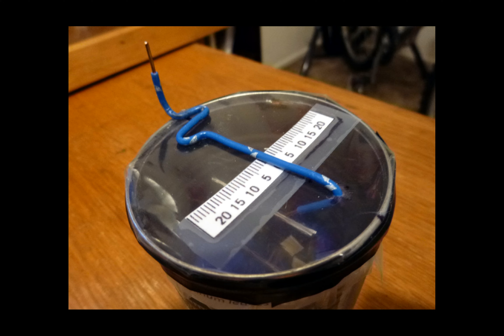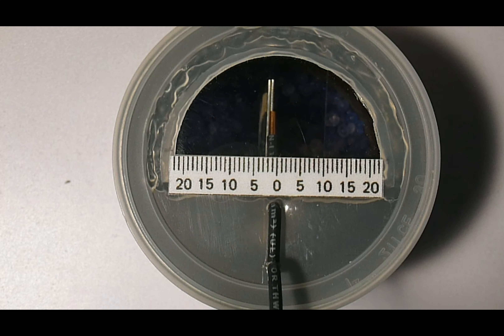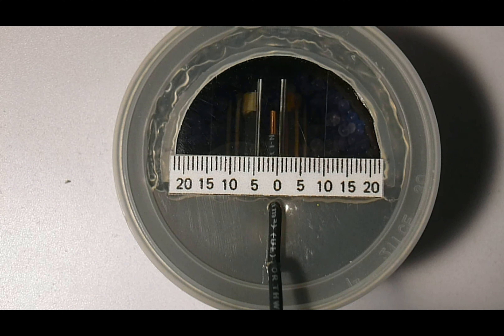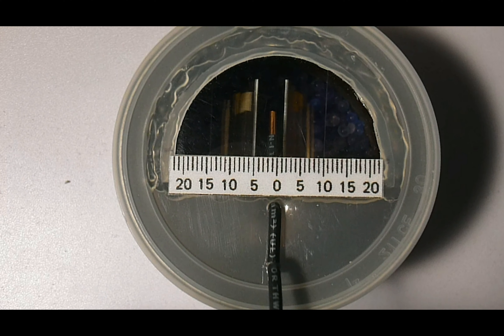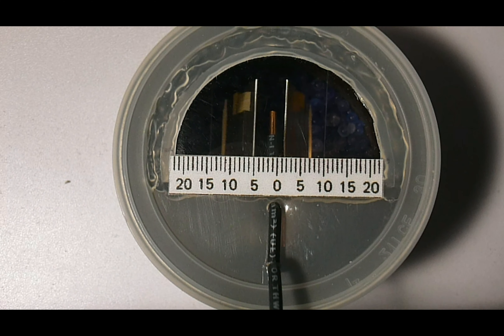It is important to make sure your meter is working properly. Place your charged meter in an area not exposed to any abnormal radiation. If after three hours its reading has decreased by one millimeter or less, this means the leaf-suspending threads are good insulators and your KFM can reliably measure dose rates as low as 0.03 roentgens per hour.